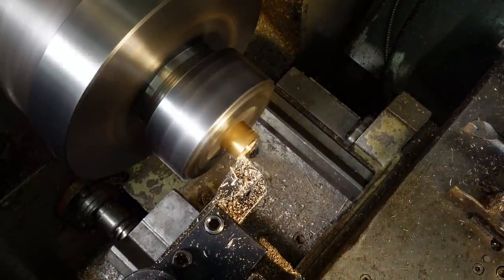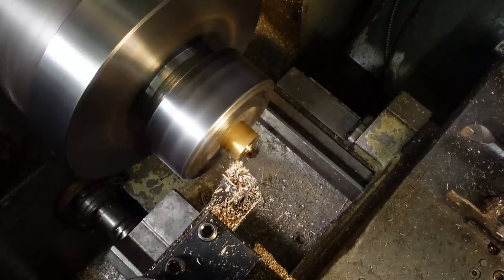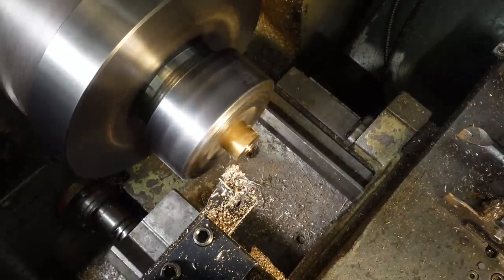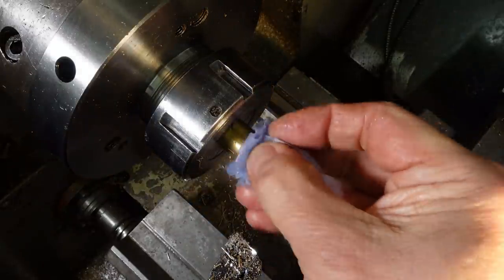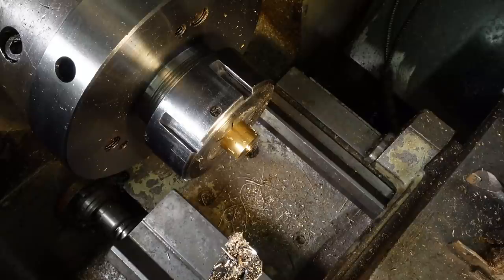This bar's a bit on the small side to use as a glue chuck, but I'm going to go for it anyway. There's a 4.2mm hole drilled in the face to match the parted off washers. A quick off-camera chamfer of the central hole and a slight break of the edge, then a good wipe with acetone, and the glue chuck's ready to roll. Well, spin.